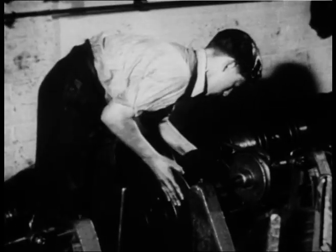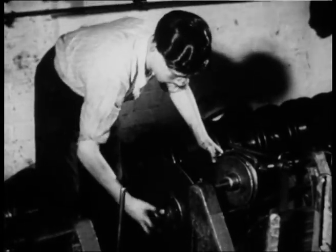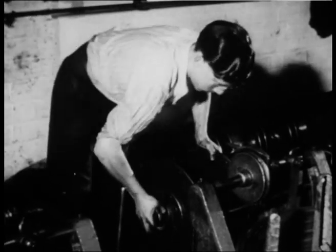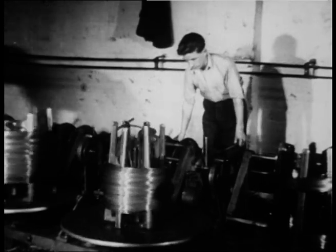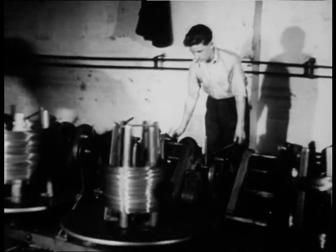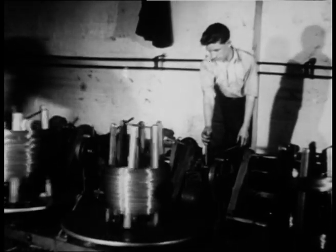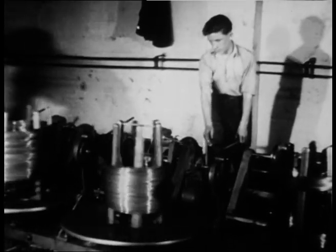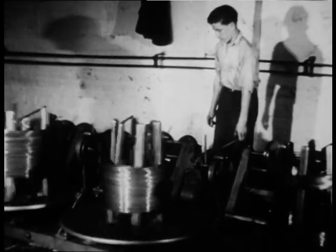This is a particularly exacting job, as the bobbin must be evenly wound to suit the stranding machine and prevent slackness and ruffles. If tangles or breaks occurred during the stranding operations, there would be a serious hold-up in the work and possibly considerable damage done to the carefully prepared steel wires. Naturally, the bobbin varies in size according to the type of machine which is going to be used.